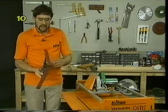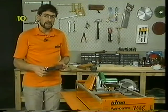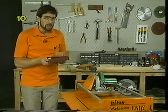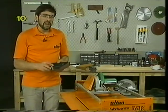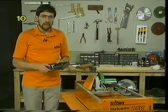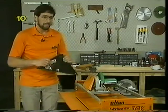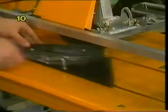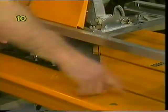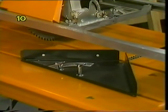The faces of the protractor are lined with sandpaper so your workpiece won't slip on the painted surface as you're doing the cut, because there is a significant tendency for the wood to creep along the face of the mitre gauge. That's why the sandpaper is there, and it will generally eliminate the need to use G-clamps to hold the work. You can lock the protractor anywhere in the slot in the table, especially if you remove the two work stops, to admit any width of timber you want to cut.